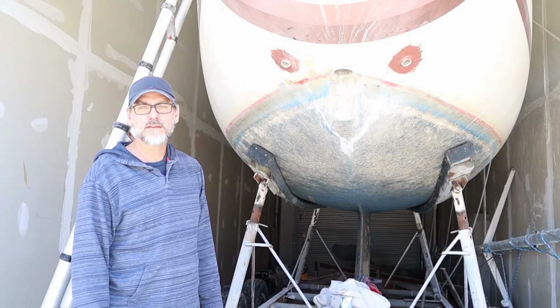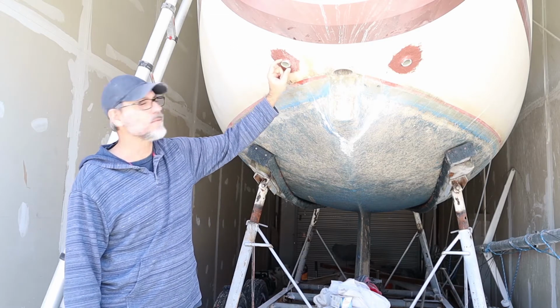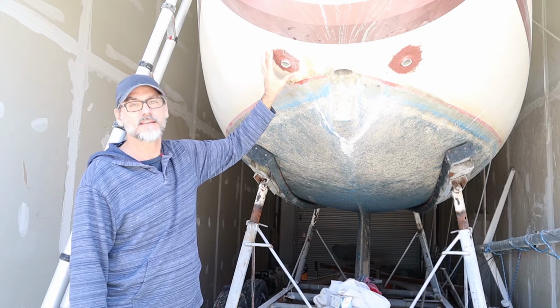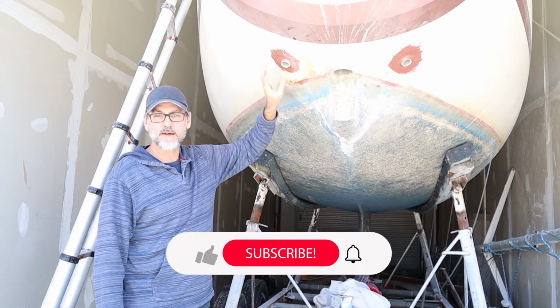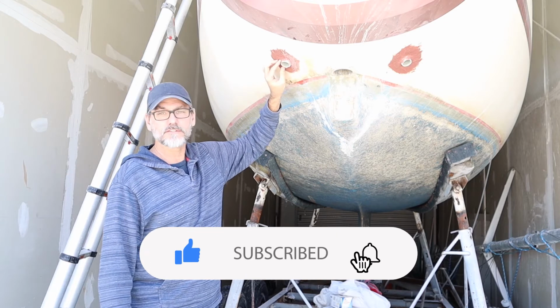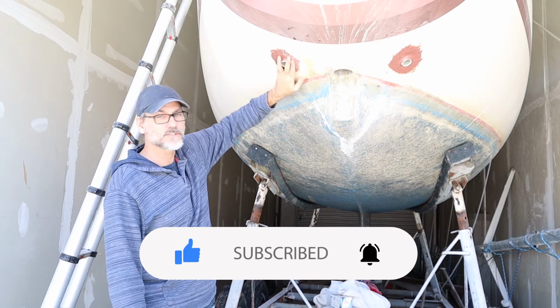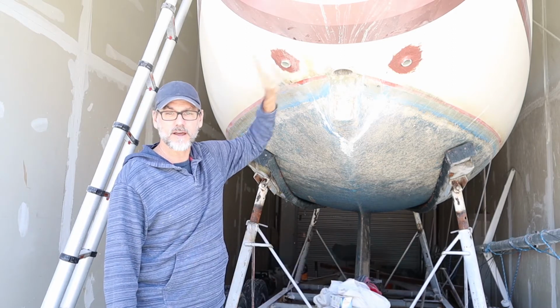Hey, what's up everyone? You saw last week I fiberglassed these in. This week I'm going to fair this back and sand it. I put some fairing compound here on the surface before I sanded to fill up any gaps or whatever. I'm going to sand all this back and try to smooth it off and then re-fair it.